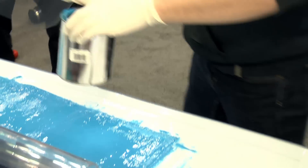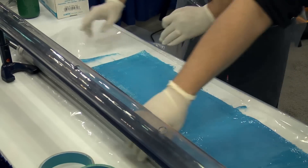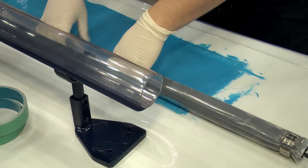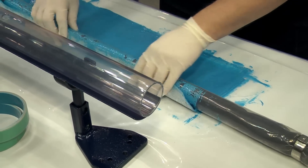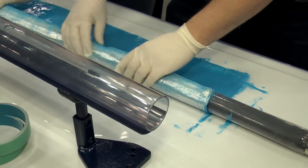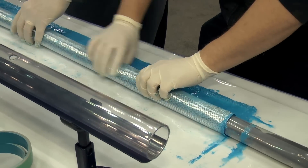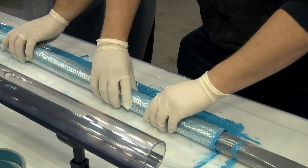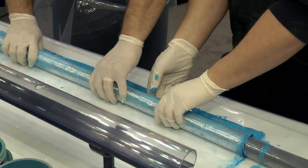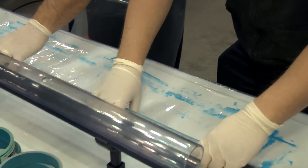Our wet-out is complete. Now what we're going to do is roll the fiber around the bladder. We put it at the same level and then roll. For experienced people, a 100-foot repair is a two-man operation. Right now we're two-man on just a few feet, but it's not far-fetched to think that you can do the same with a 100-footer in a four or six-inch pipe diameter.